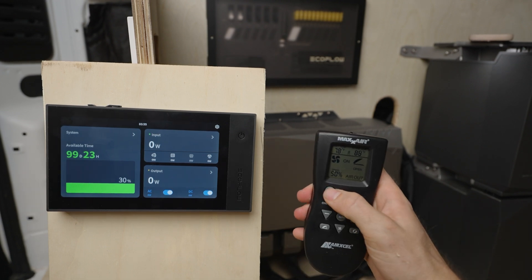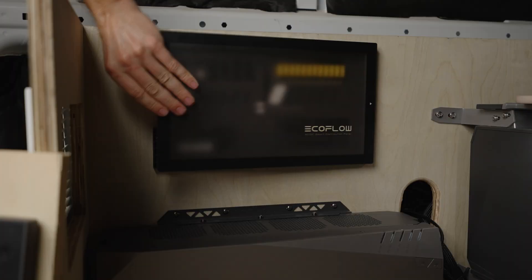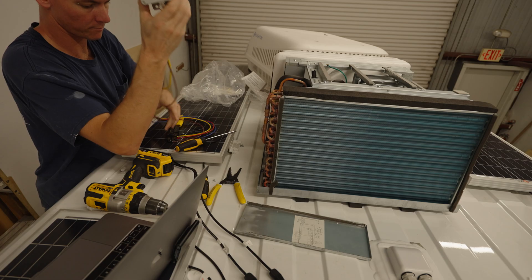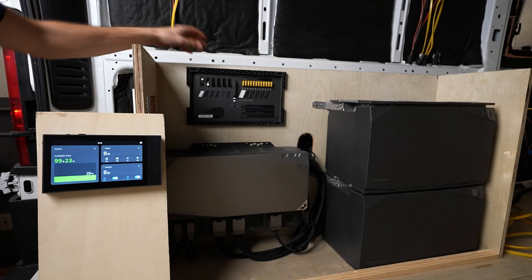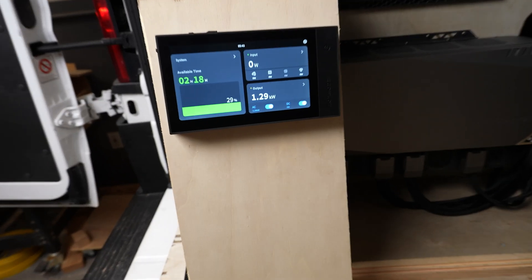Now to test out the MaxAir fan. Looks like the DC power works and you can see how much power it's pulling here. To test out the air conditioner, I need to flip the breaker on. It looks like the air conditioner still pulls too much power on startup for this system, even with the 30 amp breaker. That's an easy fix — after installing a soft start, it works like a charm. That initial pull of starting up the compressor just takes a ton of power. A soft start lowers that initial pull and eases the whole system up to speed. Once it's running, this air conditioner pulls about 1200 watts, and with that cycling on and off overnight, this 10 kilowatt hour battery system can handle that all night long.